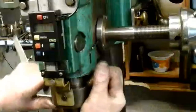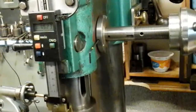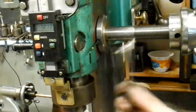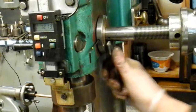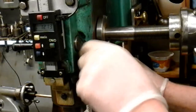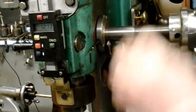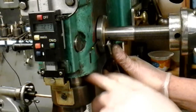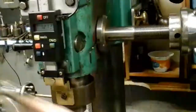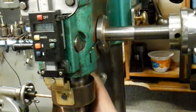I may just have to do some little fine tweaks so I get it running nice and freely. I'm using this spanner - I've put two holes in the bush - and that bronze bush now rotates independently to this flange once this grub screw's loosened. That offset then pushes your shaft into the rack of the quill and eliminates all that backlash. You adjust both sides the same till you've got as much backlash out as you can.